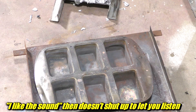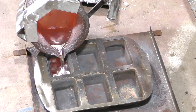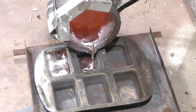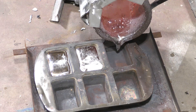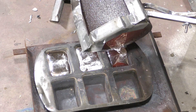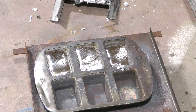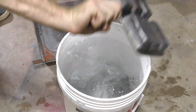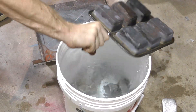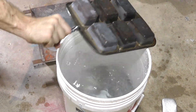For the next pour I zoomed in a bit closer. These tongs are actually really easy to control — I had the crucible clamped a little better so it came right out of the spout, and it was easy to get it down close and tip it. It's much easier to get close to the mold when the crucible isn't full to the brim. I shook it a bit — probably shouldn't have — because some dross fell out of the ingot. Also worth noting: aluminum holds a lot of heat, and dumping 600-degree ingots into water will heat it up significantly. The IR thermometer read 120 degrees after — not boiling, but definitely not comfortable.